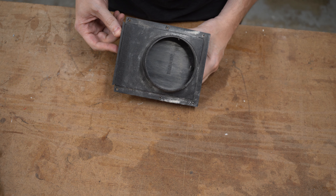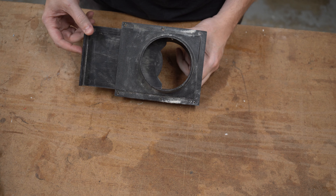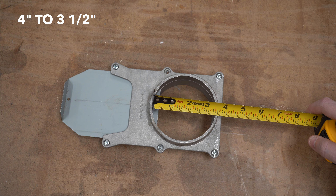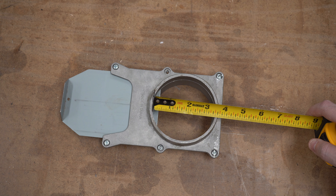The plastic and aluminum gates also have minor flaws that don't allow you to open the gate all the way. These gates are made to allow flex hose to clamp around them, so you're already taking your hose from four inches down to three and a half, which is a 24% decrease in airflow already. And since you can't open the gate all the way, that adds another three percent on top of that. While that itself seemed like it wasn't a huge deal, the bigger issue is the flat surface the air hits, which adds extra friction, therefore reducing airflow even more.